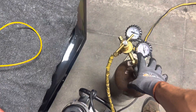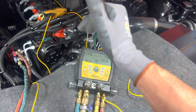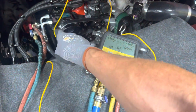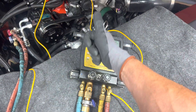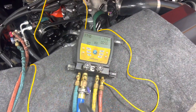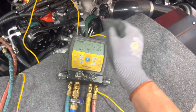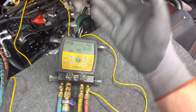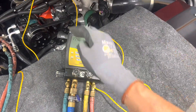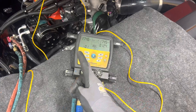Say I pulled this gas out of a cold garage at 68 degrees and the vehicle was sitting in the sun at 140 degrees inside the cabin. If I put cold gas in really fast and shut it off, you'd see the pressure go up a few tenths as the gas heats up in a closed system. Nitrogen doesn't change much with temperature, so it only goes up a few tenths — maybe a few psi in a big system with a large temperature swing. Let it sit overnight as temps drop and it'll go down a few tenths; put it back in the sun and it'll come back up a few tenths.